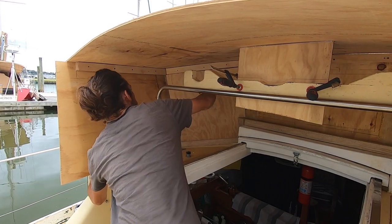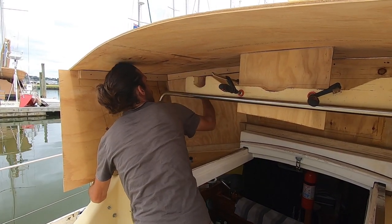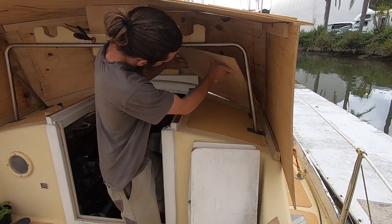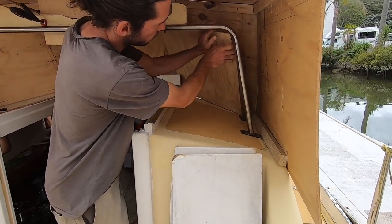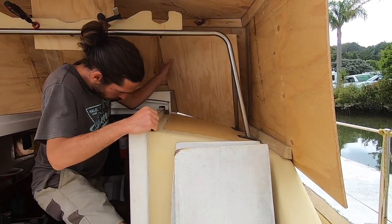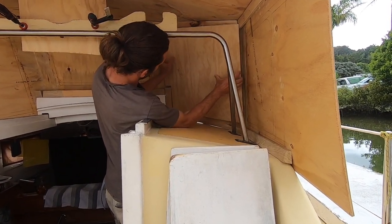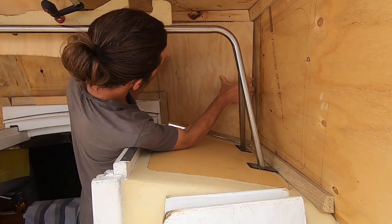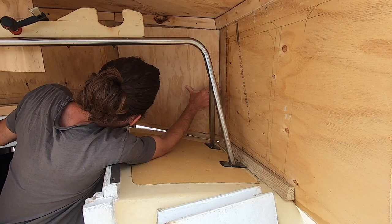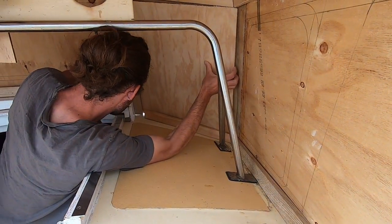Then I beveled a few lengths of solid wood and made a support frame behind the plywood, which was temporarily fixed together using a hot glue gun. I applied a few strips of fiberglass on the 4 corners of the structure, inside and outside, and let it dry overnight. The next day, I trimmed the dodger to the proper height and bolted a skirting frame using 2 strips of plywood and covered the whole unit with another sheet to make the top part.